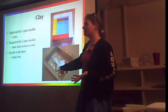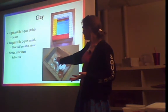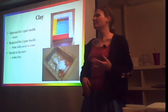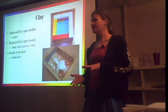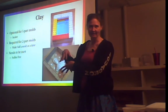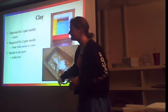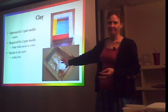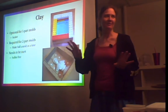A two-part mold: you embed your piece in clay, put the box around it, add a chemical called mold release, pour the silicone, let it set, turn the box over, take it apart, take it out, turn it over, put the box back together, then pour the other side with more release. You put little keys in so when you put it back together it aligns correctly. It's way more complicated — I know how to do it, but it's not something I can demo in 45 minutes. And sulfur-free clay is the most important thing for two-part molds.